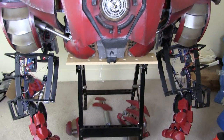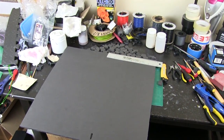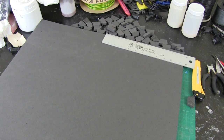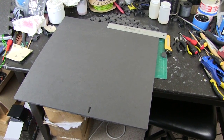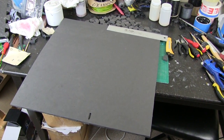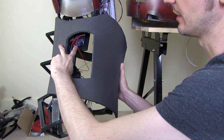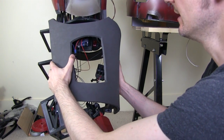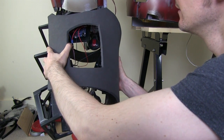I'm going to be doing exactly the same with the arms. I've already chopped the knobs off the edge of this floor mat. Here's a whole mat — unfortunately this one's got a slight defect in it but I don't think that'll matter by the time I've put the next layer on. With the arms I need to leave a cavity so I can still get to the mechanics, electronics, and other bits and pieces, so I'm going to make several small sections which stick on and the top layer will be removable in some places. Here's the first piece which is going to go on here — I've got that hole there so I can get to the programming socket of the Arduino and get to the mechanics inside. This is a bit of an underlay so there are going to be another couple of layers on top, and I've also left this cutout here which will have something in it in the future that lets the arm shut fully so it hits the end switch.